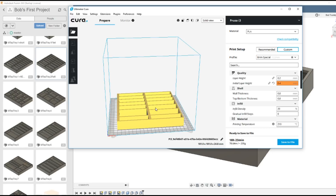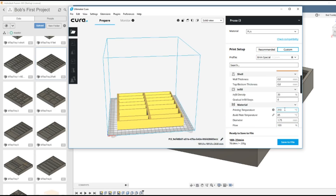This particular one was fairly busy and the print time is 18 hours and 23 minutes. I don't think I ever printed this one - I'm not sure. It uses almost 80 meters of filament. Printing temperature on the print head is 210 degrees and the build plate is 65 degrees. For infill density, all the inner parts of these features just have a shell around them, and the rest of that 1/8-inch thickness is filled with a grid inside that occupies 20% of the space.